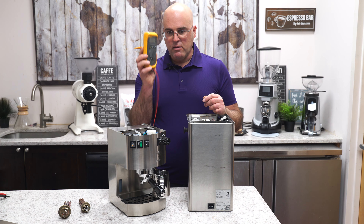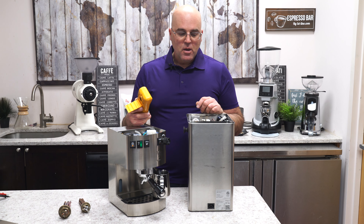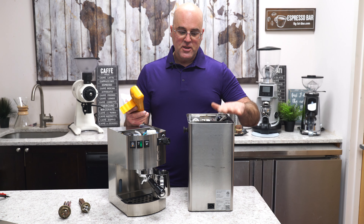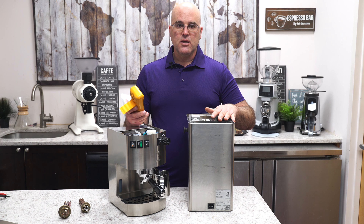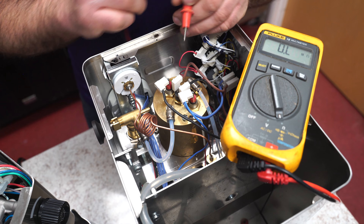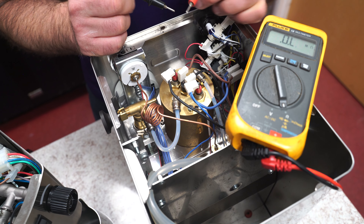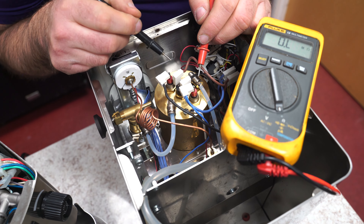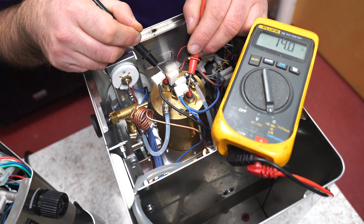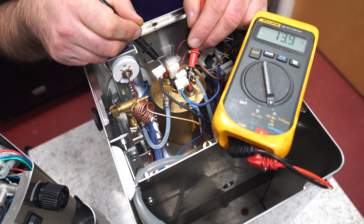They're the ones making the sale — we don't sell these. Let them explain it or read the manual. We're going to now get started on the non-hot machine, which is the cool machine, not plugged in. I have the multimeter with the horseshoe there. As you can see, there's a little resistance there. But here's our heating element post — so if the heating element goes bad, we could check that. Again, the machine is not plugged in. We have about 14 — close to 14.